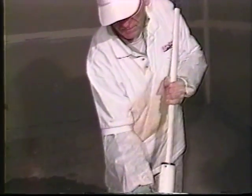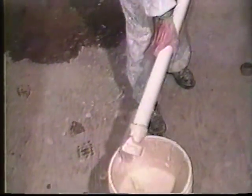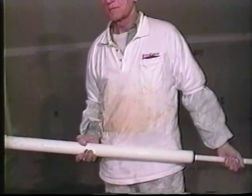Draw the mud up into the tube. And then move steadily along, slowly depressing the handle. The corner applicator leaves a trail of mud on either side of the corner, which once again is smoothed out and spread with a corner flusher.